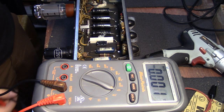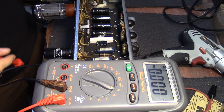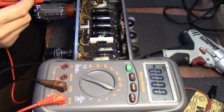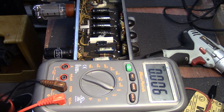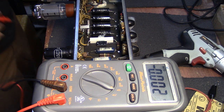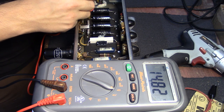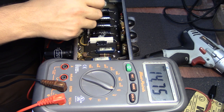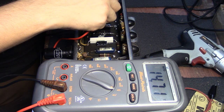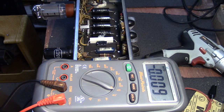I played this amp probably about 15 minutes ago, and I want to show you that these filter capacitors are going to continue to hold a charge — they're going to hold a voltage on each of the nodes after the amp is turned off and unplugged. You can see the amp is unplugged, and I've got my multimeter testing for voltage. I'm going to put one lead on the chassis and measure the positive end of each of these capacitors. That one's 14.8 volts, 14.7, 14.75, 14.72 — so all those capacitors are still holding a charge.